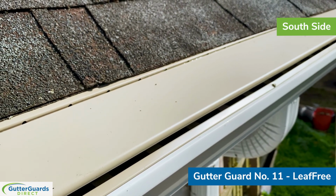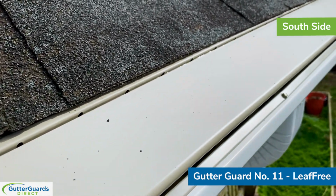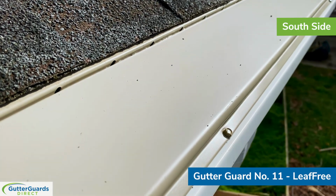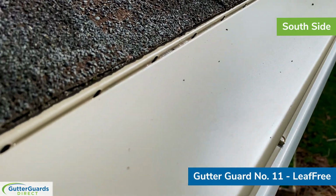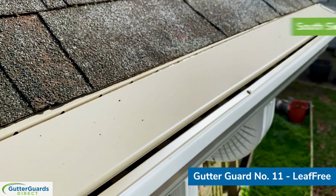Again, we just installed this one 24 hours ago. We had a good rainstorm last night, and you can see the cover has just got a few shingle granules sitting on top of it, and you can see the weep holes retaining a little water in there, so you can kind of see how that system works.